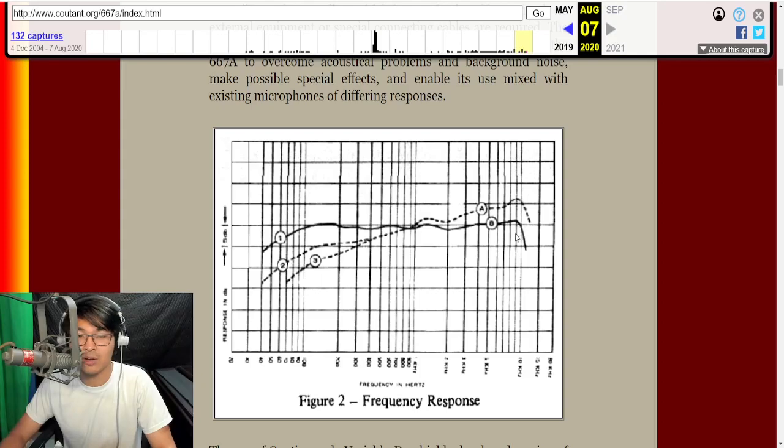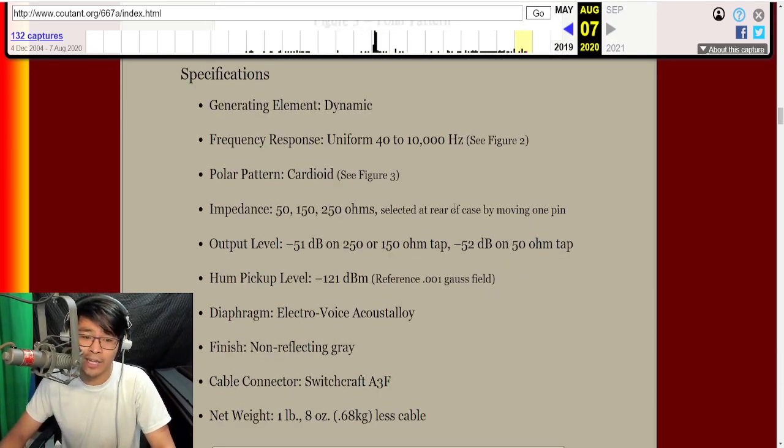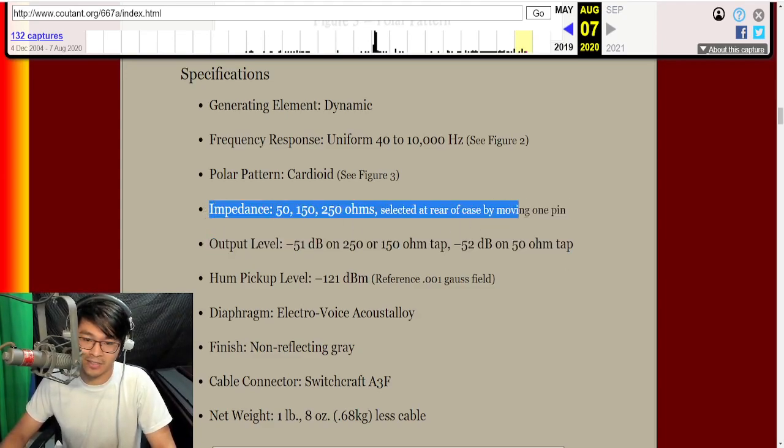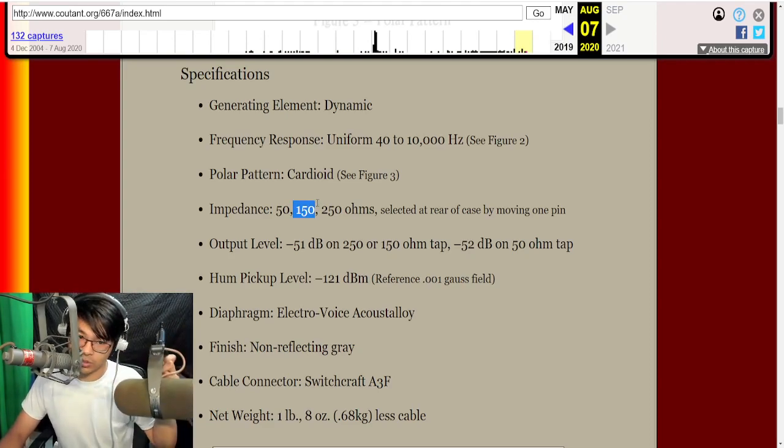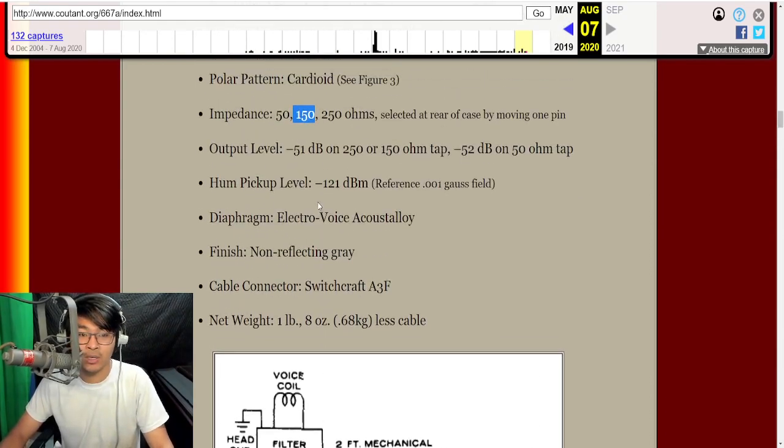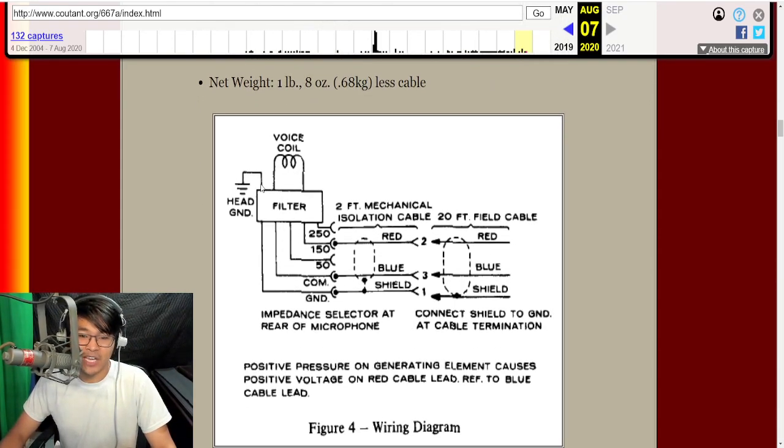The big thing is impedance — this is something that really nobody thought about. We have different kinds of impedance; there isn't really a big change in output gain, but the fact that you can impedance-match is pretty cool. We have 50 ohms, 150, and 250 ohms. From what I've noticed on my ART voice channel, if I increase the impedance it actually increases the output gain, so keeping it at 150 is consistent — especially for doing tests, since the Shure SM5B is also 150 ohms.